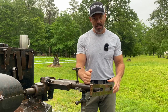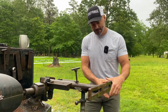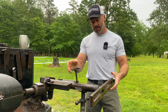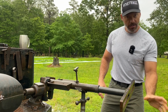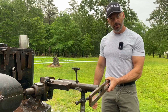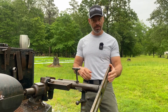This is a piece of Schedule 80 2-inch with a piece of 1.5-inch Schedule 80 in it, and it has very little slop. I mean, just a little bit. And seeing that it doesn't have bearings, there's a feature I really like. You can pull this mug out. You can have your jack stand and your fitting here, so you can wrestle it up out here, whatever big heavy flange you got. And then you can undo that, bolt it up, drop the jack stand, slide it in. And then roll it to wherever it's good, put your counterweight on it.